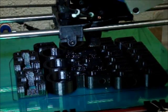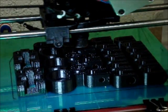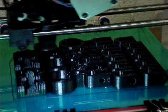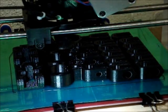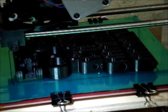Without a heated bed, if you print just on blue tape, you can actually start printing within 10 seconds of when you pull the parts off. You don't even have to remove the plate — the parts just pop off pretty good.